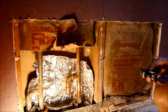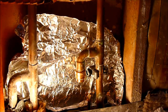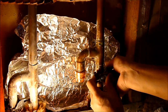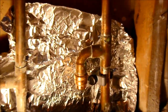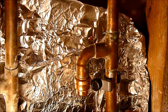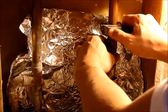Turn off the hot water — turn off the water. There's a lump here, but actually I'm going to cut it above the lump. This one is a little elliptical so it's hard to do, but we manage the turning. The water starts to leak out even though we turned off everything — it's from the residue, so we're going to leave it until it's gone. The water was draining from the top, so it stops now. We can cut the top one, the main line.